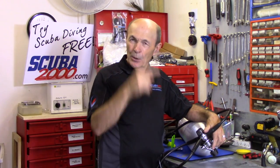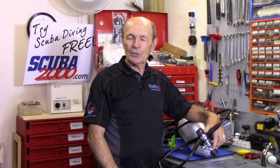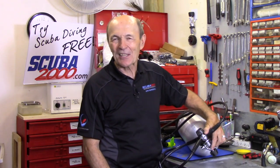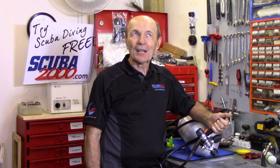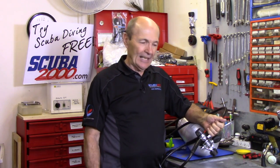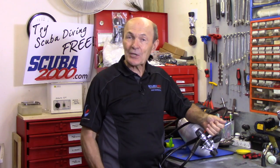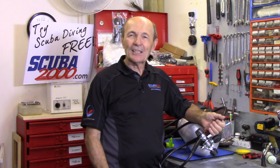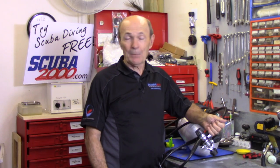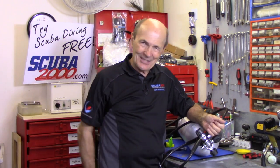Really, very simple. If your pressure gauge is going up and down like this, it can only be caused by one of two reasons: your valve is not completely open — make sure it's completely open — or you have a J-valve on your tank, which is highly unlikely. Maybe we'll talk about that some other time. You can learn about J-valves on my Alec Pierce vintage scuba. Anyway, that's the answer to your question. There was a question and there's the answer. Hope there is some interest to some of you out there. Alec Pierce scuba — talk to you soon.